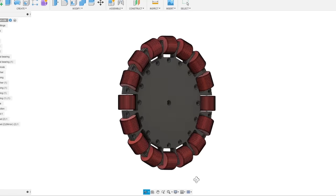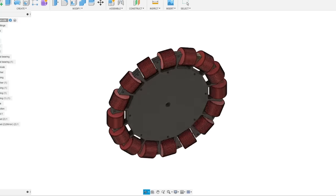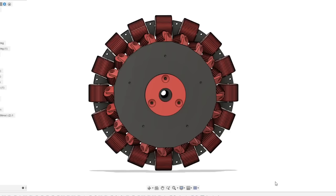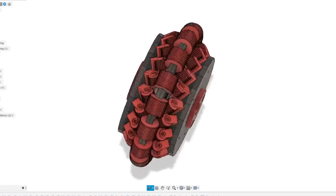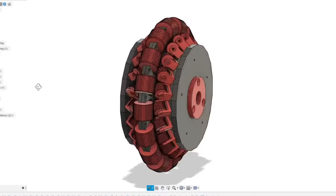For this reason I'm going to ignore that part and just mount my small output wheels on a central mount plate like a traditional Omni wheel, and use many more smaller rollers on my powered hubs. The patent pictures the small output wheels curving so their surfaces follow the contour of the wheel; in reality this is going to be very hard to achieve unless each wheel is very soft and flexible, which would cause other issues once a load is applied. My output wheels would just have straight sides and I suspect that this will cause some issues with inconsistent traction between the driven hub rollers and the output wheels because they won't follow a circular contour — instead the contour is going to be made up from lots of straight lines, but we'll see how that goes.